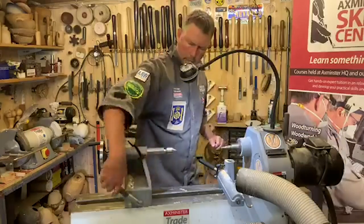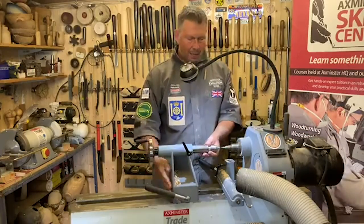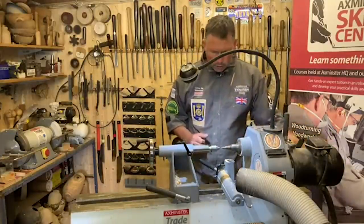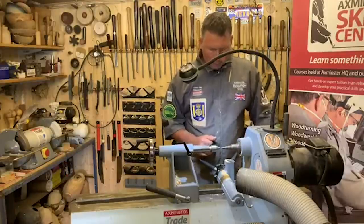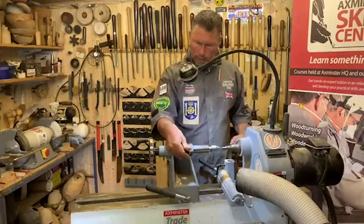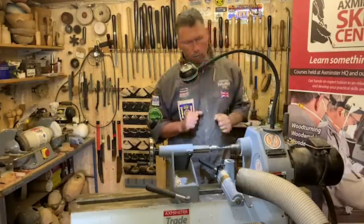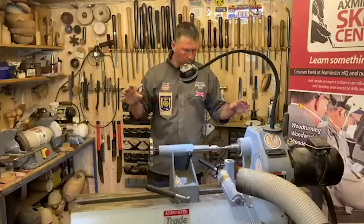So we're going to bring this up, and it's called a kiss test. Basically, you're aligning the 2 points, and you're moving just by hand. There we go. We're aligning that up, and as long as those 2 points meet exactly, we're happy. If you can't do that, there is probably a very, very good reason.